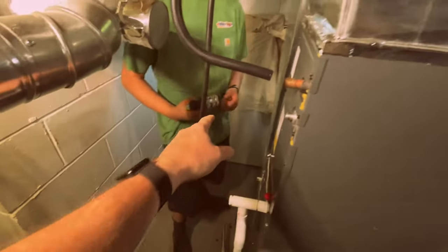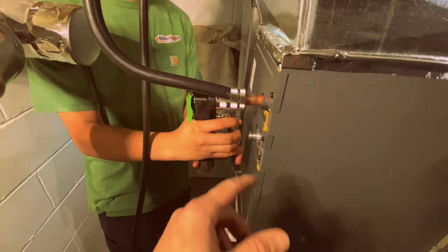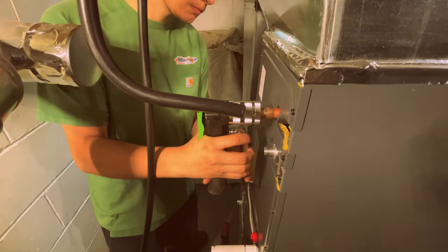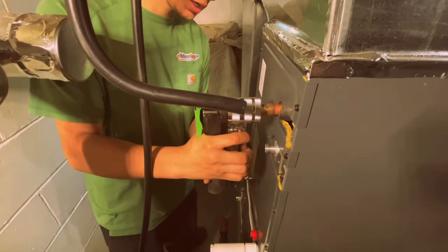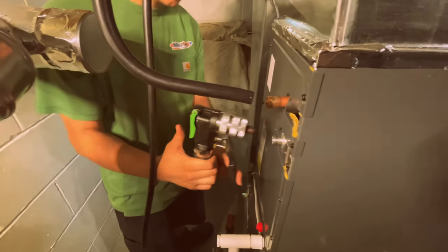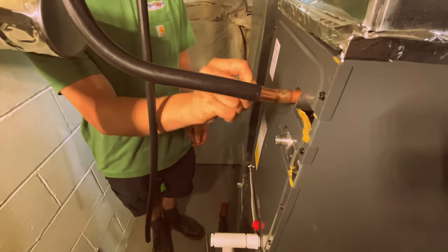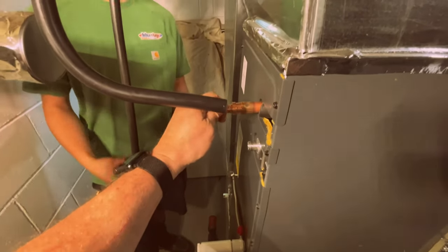Yeah, you take your Hilmor swage toolkit and stick it in there. And you just keep pumping it until you start feeling some resistance. You don't want to do it too much. Feel some resistance now? Yeah. Okay, now hit that button. Yep, this one right there. Okay, now I'll try to stick that in there and see if it goes in. You have to grab a hold of it and then there you go. Perfect, yeah. And when you do it, you want to keep it out just a little bit.